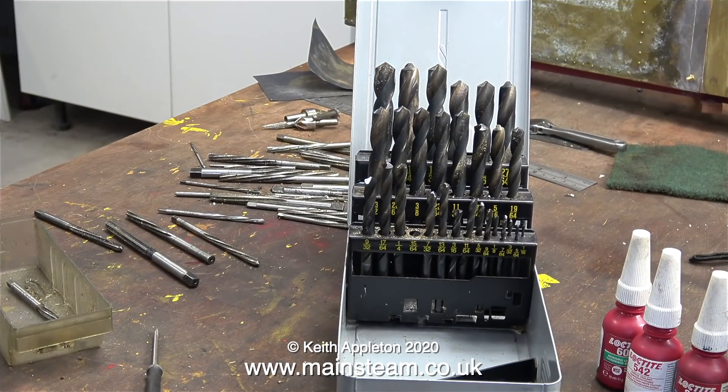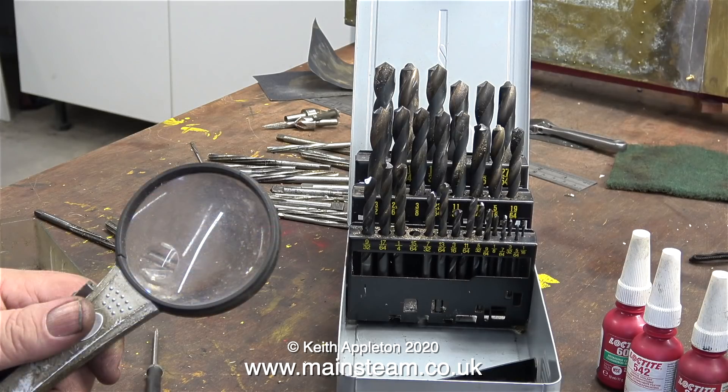Time to look at the combination of using drill bits and reamers — not at the same time; you have to drill the hole first and then ream it. And what's the magnifying glass for? I find this invaluable these days to read the sizes on reamers, drill bits, and taps — particularly on small reamers, drill bits, and taps.